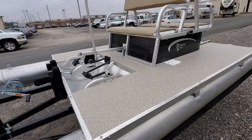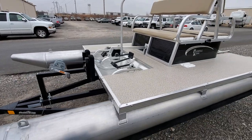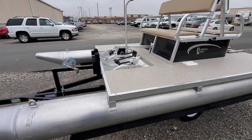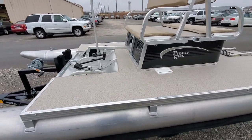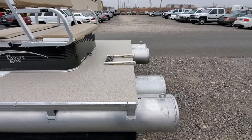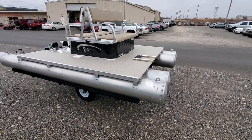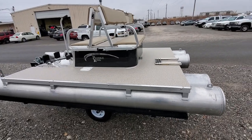I do want to touch on real quickly — all these bushings here, for lubrication you use a white lithium grease. They are compatible with the nylon bushings. That's just in case anyone out there has got questions on that — hopefully that'll answer it. All aluminum construction is going to last for generations. I appreciate y'all, thank you so much. Have a happy new year.